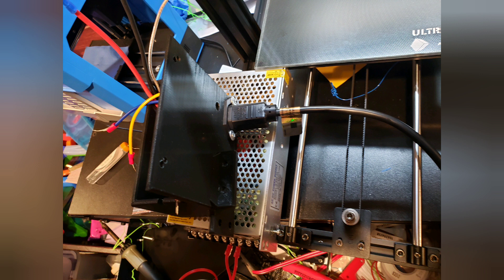When you're running 24 volts to your bed, make sure your bed is set up to take 24 volts. Usually it's just a different configuration of how the connectors are attached or soldered. On the Anycubic Ultra Base it's really simple — there's a jumper where you just snip the wire, and then you're set up for 24 volts.